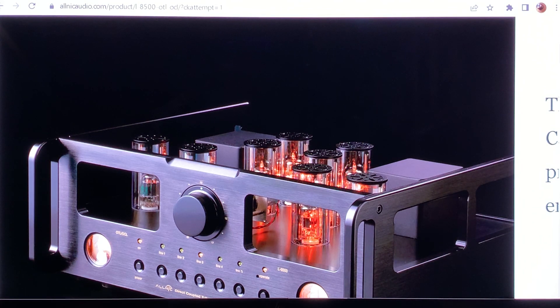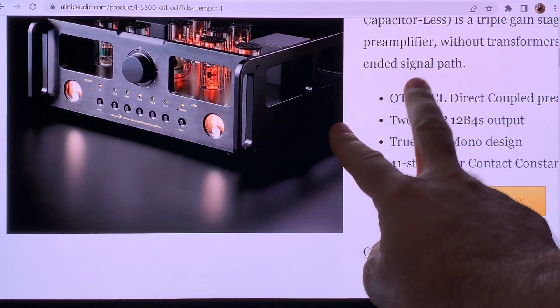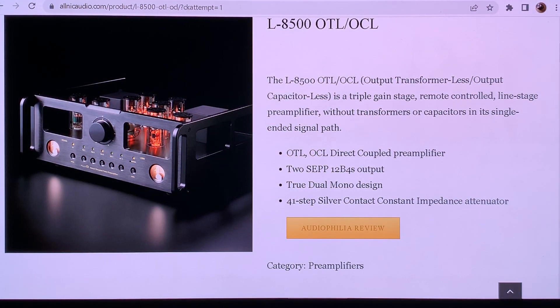A solid-state regulated supply will have a sound that's more on the mechanical side — probably giving a lot of raw power but not much refinement. What I would have done instead, to keep a similar cost and size, is use a single, much beefier power transformer with at least one choke and a rectifier tube to supply the high voltage. That would have made a unit whose sound is much more in line with what people who buy such gear imagine it would sound like.